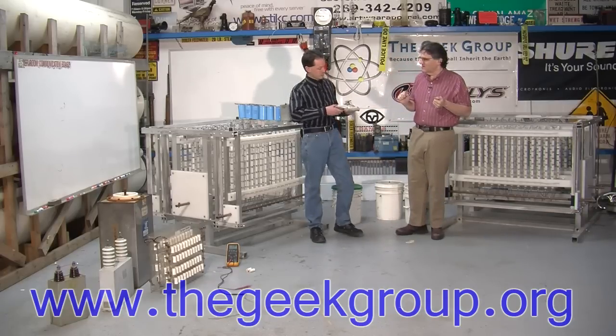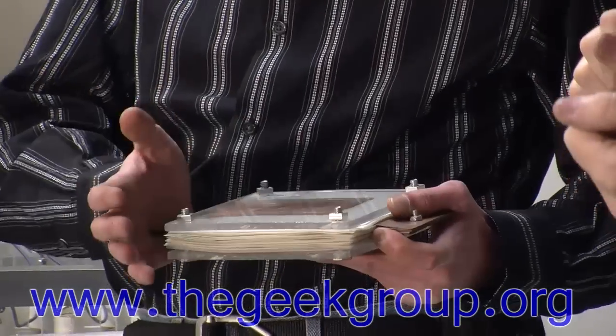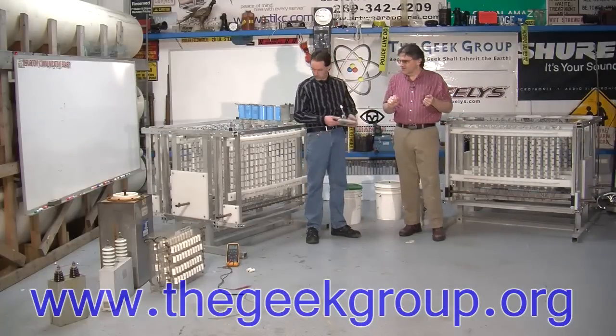So if we were to grab this and pull so the plates roll out of overlap, it'd be a lower value capacitor. Correct. And that's how the air variable ones work, by rotating one set of plates. Correct.